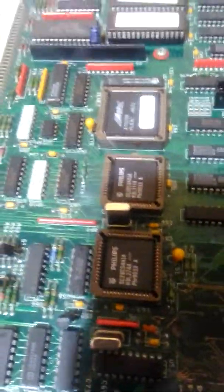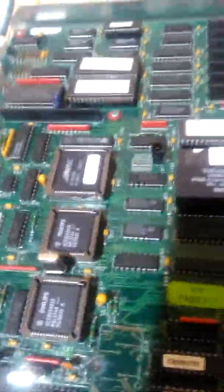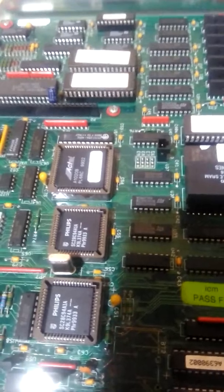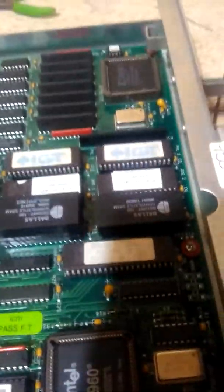Other than that, if things are working pretty well I wouldn't stress too much about it. Sometimes on older boards they won't go until it's warm, and I'm guessing that's a case of thermal expansion — you might have some cold solder joints somewhere on the board, and it kicks in after that, which can be quite hard to trace on a big circuit board like this.